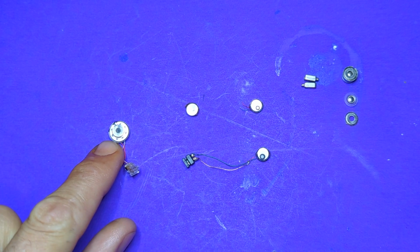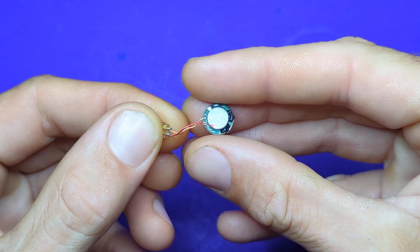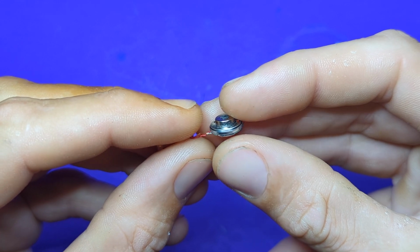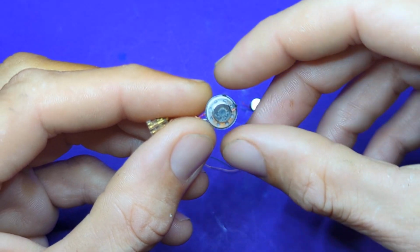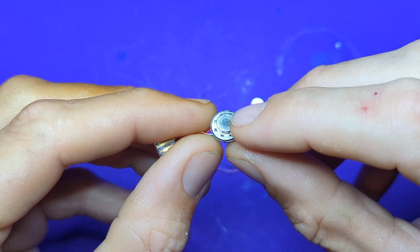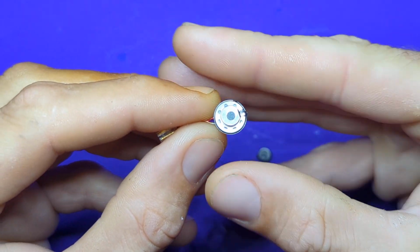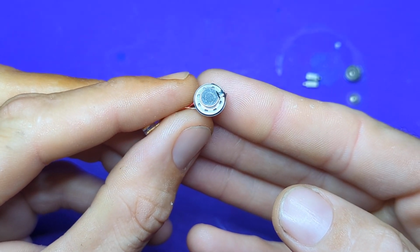So this is the Rinko driver. I believe the driver was made by QDC. You can see it's a combination driver. So there's a 10mm biofiber, I believe. It's really thin. It's like a TWS style driver. But so there was this that came out not too long ago, and it has a 6mm flat panel driver on top that QDC created, and then it has the 10mm dynamic underneath it. So this is one of the iterations of these drivers.